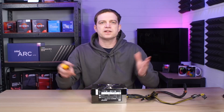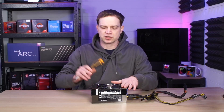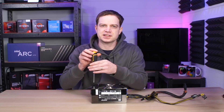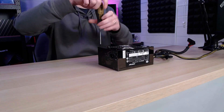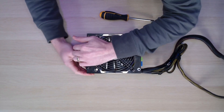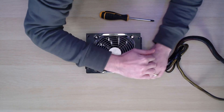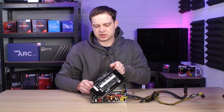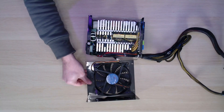The first thing we need to do is get a screwdriver and take the lid off. This power supply has been drained so it should be perfectly safe, and fortunately we're only changing the fan so we don't actually need to touch the dangerous bits anyway. We'll show you what that is once we get in there. We need to remove the four screws from the corners, and now they've been removed we just need to lift the lid — break it free from this side. Sometimes they can be a little bit tight, but we break it free just like that, and then simply lift it off and flip it over to have a look at the mess somebody made.